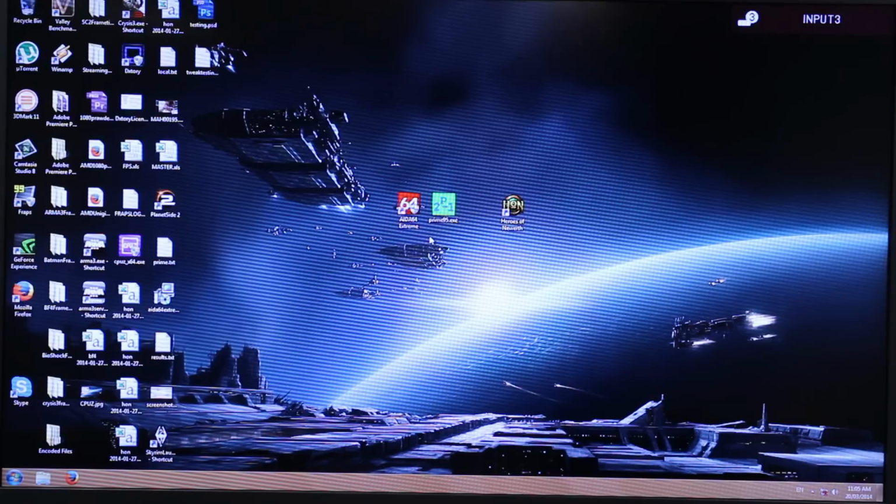So I'm going to be going over a lot of things, but I'm going to be keeping it as simple as possible. The first two programs I recommend getting are AIDA64 Extreme and Prime 95. AIDA64 does have a 30-day trial, but that is honestly more than enough for finding a stable overclock. Prime 95 is optional, you actually don't need it, but I always like it because it takes the temperatures higher than AIDA64 does.